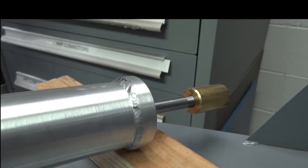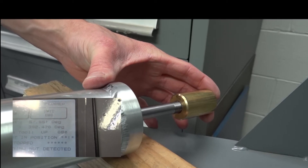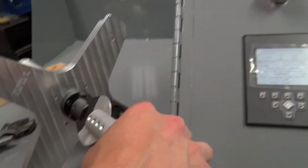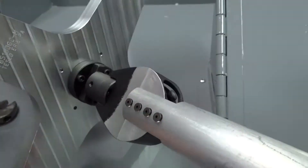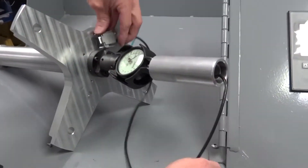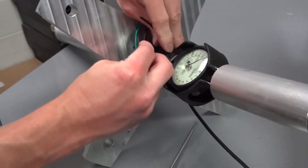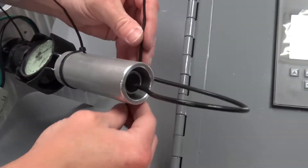Once the compression fitting is tight, press in on the brass knob and hold it there. Verify that the screen changes tram tool to up and displays a number between 650 and 700. Disconnect the LVDT cable from the tramming tool and slide the metal sleeve back into place over the LVDT sensor. Replace the four hex screws in order to hold the sleeve in place. Reattach the connector and ground wire to the arms of the tramming tool. Finally, add zip ties back onto the cables in order to prevent them from being damaged. The tramming tool is once again ready for use.